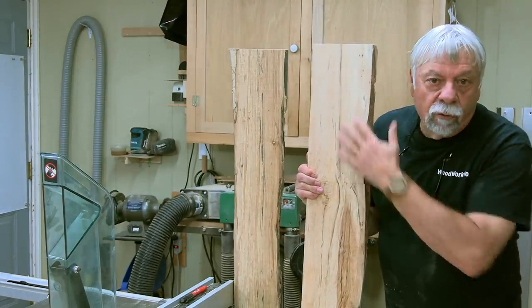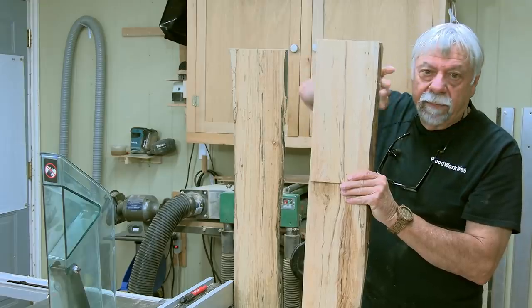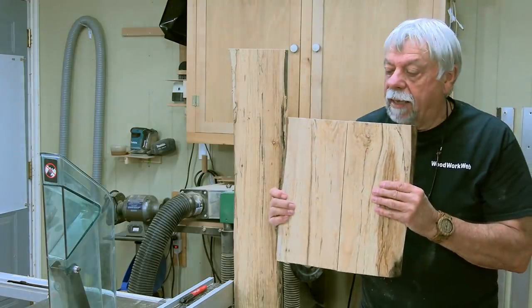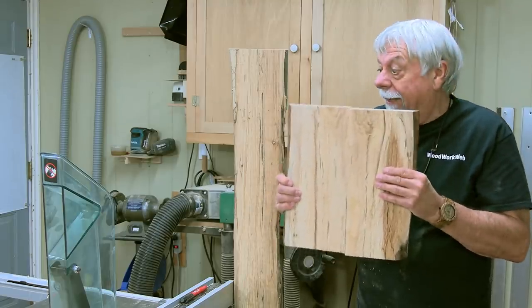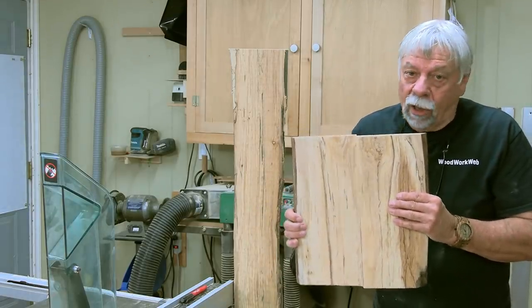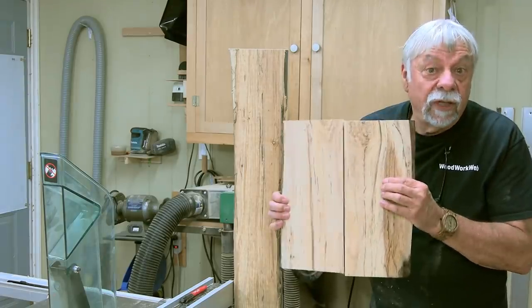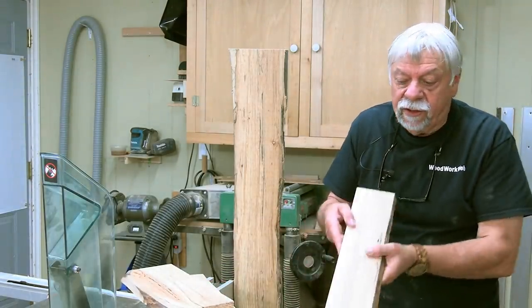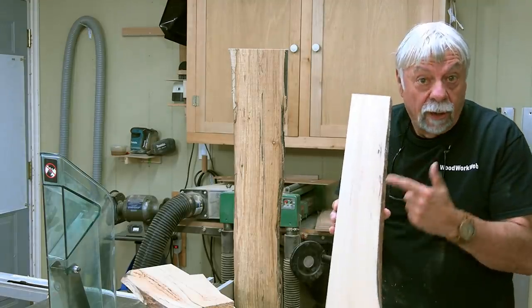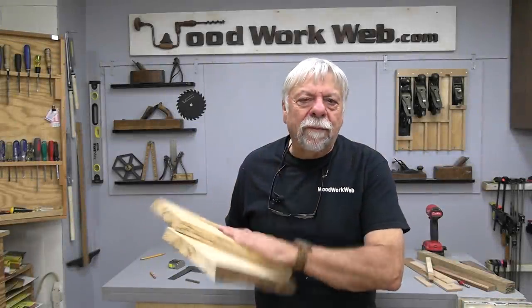You'll end up with two boards — something like that — so you have a board that's five inches wide. Take that board, clean up the two edges, cut it in the middle, and fold it together. Now you end up with a board that in this case is ten inches wide and maybe a couple of feet long of all spalted alder. You could use that for a coffee table top, a sofa table, end tables, bedside tables — all sorts of things. Or cut off the bad edge, fold it down, and now you've got live edge on both sides with many more options.